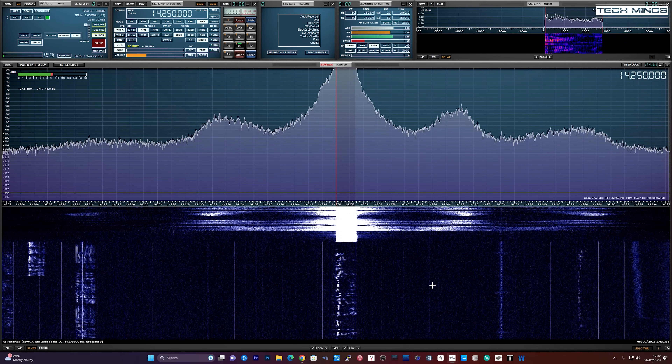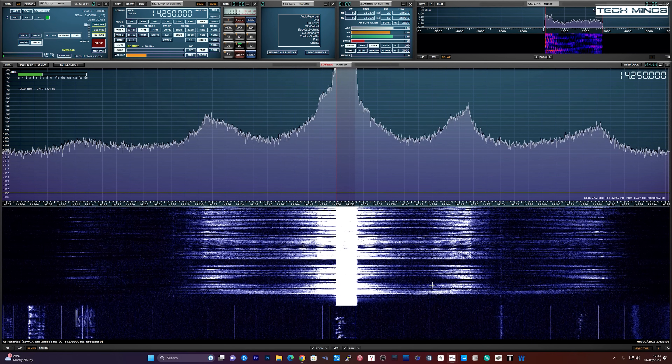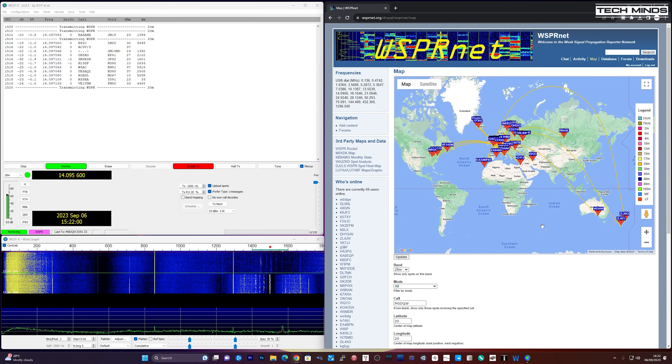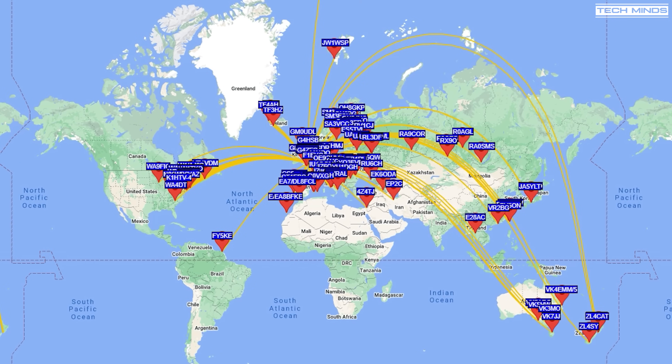At the time of making this video, 20 meters was not exactly popping, and while I was able to make a couple of contacts, I thought it would be interesting to try WSPR for a few transmissions. With the radio RF power set to 5% — around 5 watts — I loaded up WSJT-X, configured it for WSPR, and let it transmit for a few cycles. Considering the band appeared quite flat, I was surprised how far my WSPR transmissions were being heard using this JPC-12 antenna. I was received on the east coast of the USA, up into Iceland, and with a few reports from Australia and New Zealand. The antenna most likely has a low angle of radiation, helping the signal travel further around the world. I'll definitely be trying this antenna on 20 meters again when conditions improve — maybe it's a good DX performer.